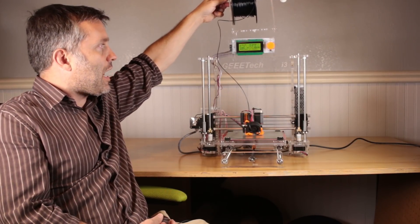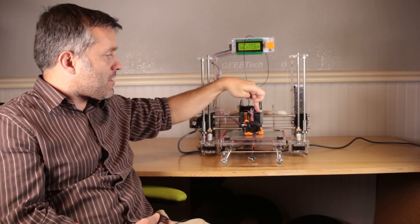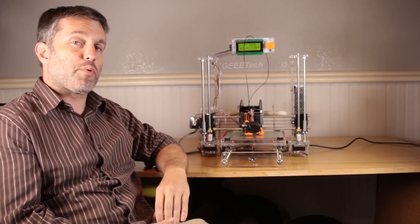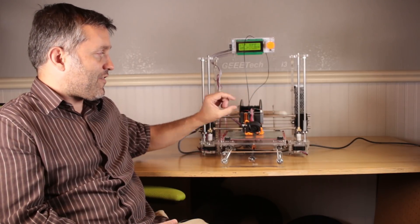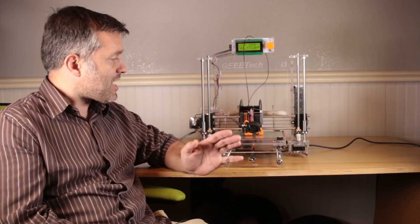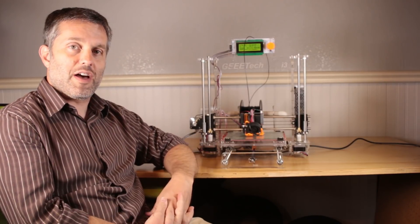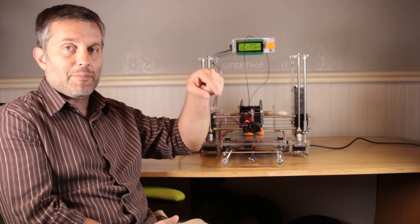That's how you upgrade a 3D printer to having auto mesh bed leveling — in particular this G-TEC i3. There are a few more upgrades I could do: the biggest would probably be putting a spool holder up top so I'm not having to feed up and over. This printer is a direct drive, meaning the extruder sits right here on the X carriage. The disadvantage to direct drive is that it weighs a lot, so you have to slow the printer down to reduce ringing on your prints. But the advantage is there's a very short length of filament after the extruder, which means you can print with flexible materials really well. We're probably not going to see a lot of direct drive machines anymore — everything seems to be going toward Bowden setups. So it's nice to have a printer like this still in your quiver. If you don't want to do all the upgrades yourself, please go and donate to my Patreon page and I'll send you the files. That's just about it for this video — click all the good buttons down below, and I'll see you next time.